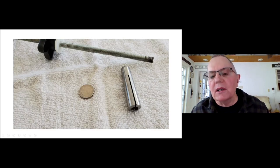And this is a collet, Morse taper. This fits in the headstock. That's all it is. You hold it in with a drawbar. These again were very popular. A lot of these go back before the chucks of today. This is a 3/8, and again for speed you can't beat it. There is no chuck, no big cost for this. This goes right in the headstock. You pull it tight with a drawbar, and it holds your piece.